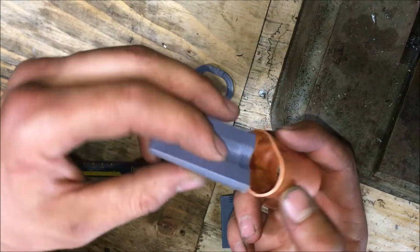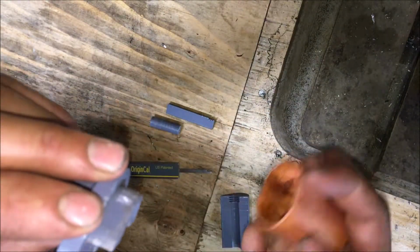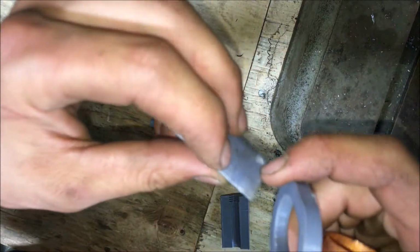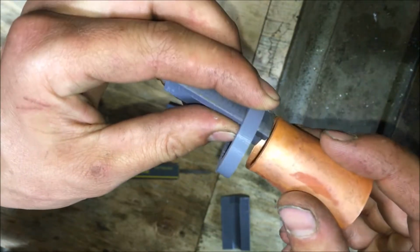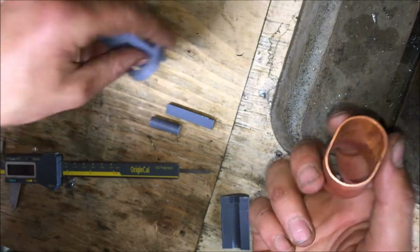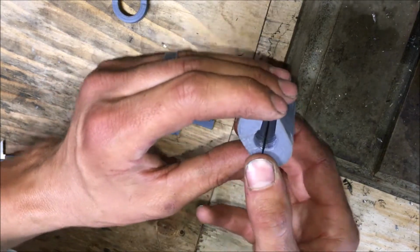So you'll see later in the video, I assembled this backwards, and that's why that retaining ring was down here. Because this has about a 1/4 inch of flat space back here where it's the correct oval diameter. So I sent it beyond, and I repressed this guy back in, and that re-ovaled it and made it a great shape.